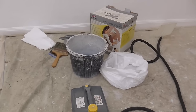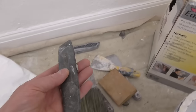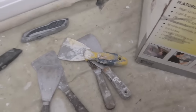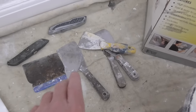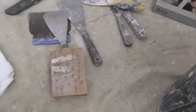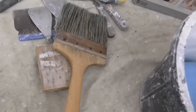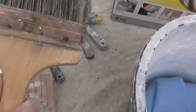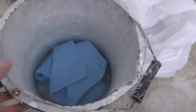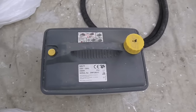Just a quick talk through of the gear and tools you're going to need. First off, a decent Stanley knife with a nice sharp blade. I've got various scrapers to see which one is best because every scraper has got a different edge on it, so some are better for different wallpapers. I've also got a nail block in case I need it, a five-inch flat brush, some plastic bags for your rubbish, buckets of water, and a damp cloth for wiping on the skirting board and woodwork.